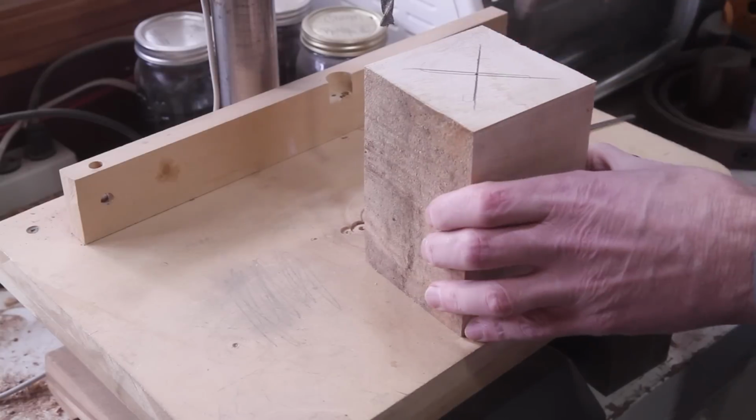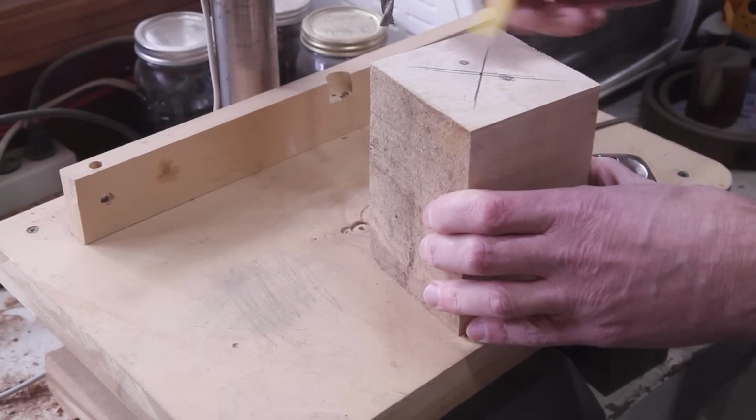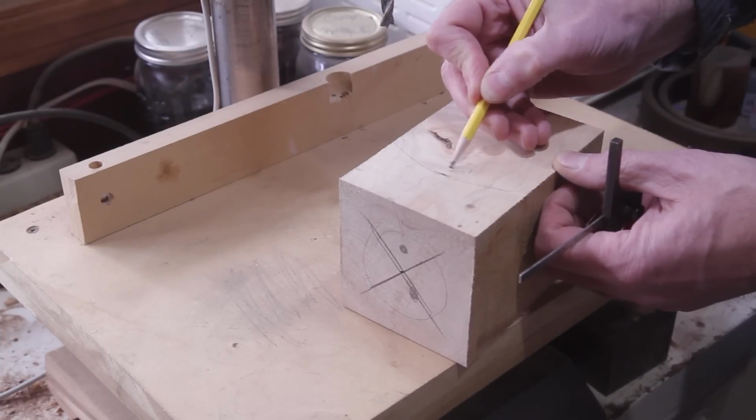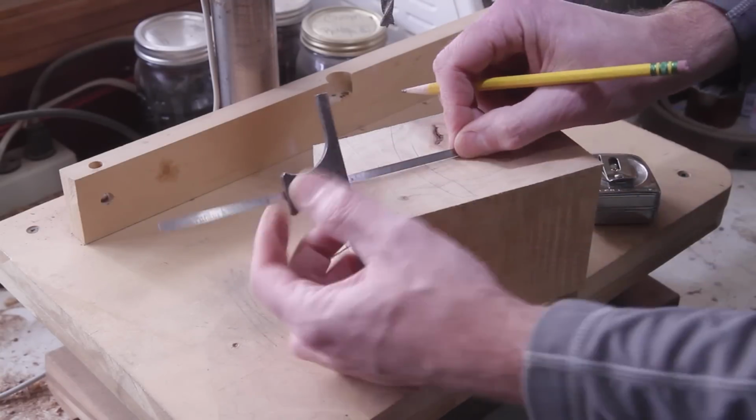On the other end, on the top, you need to drill in 2 more dowel holes. Again, I used the 3/8 inch. Now, what I did is I roughly marked where the arc was going to come across there, and I went about 1/2 inch under that. These dowels need to go all the way through the 3 pieces after you get this cut.